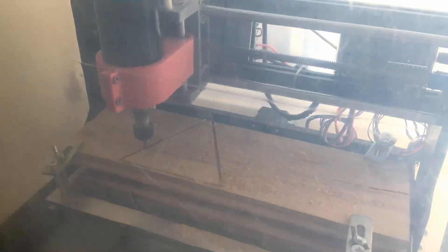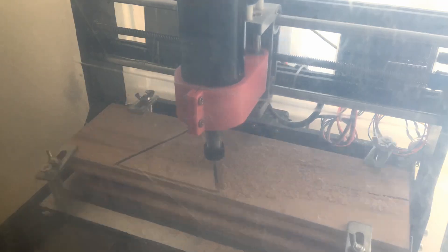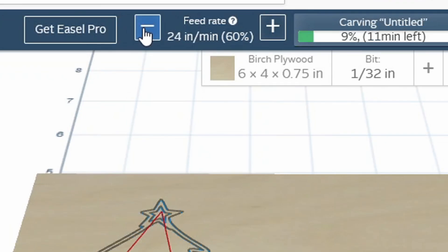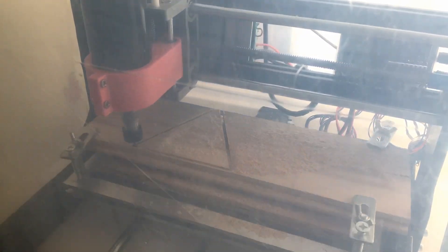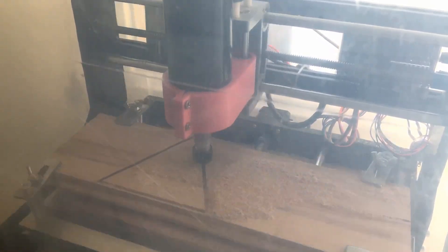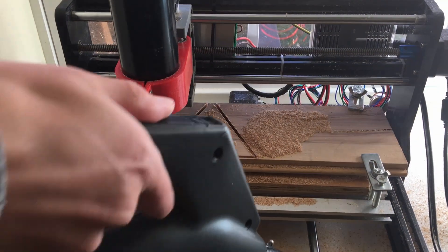Easel has a feature where you can adjust the speed that the bit moves after you've started a CNC job. You can adjust the feed rate manually during the carving if your CNC is going too fast or too slow. If you're getting a lot of chatter, you can slow down the feed rate; alternatively, you can speed up the feed rate if the bit is rubbing. This is important to fix because if the bit is rubbing, it will cause the tool to heat up and shorten its lifespan. I originally didn't leave enough of the end mill sticking out of the collet chuck, so I couldn't cut all the way through the material, and I had to restart this operation a second time with more stickout to finish cutting the ornament out.